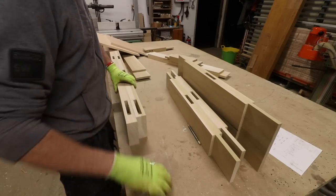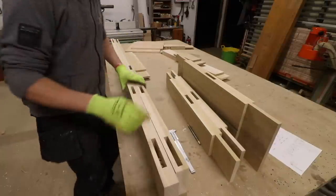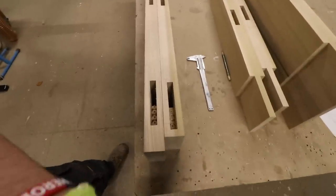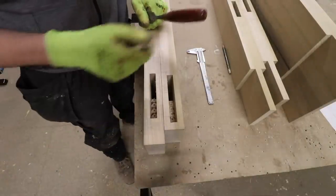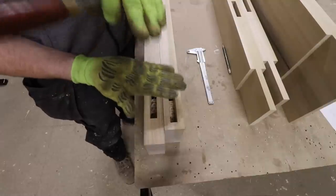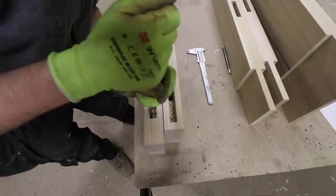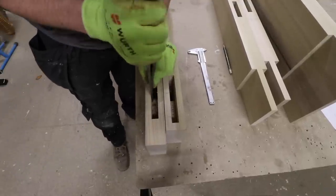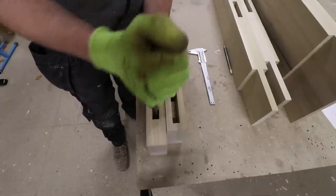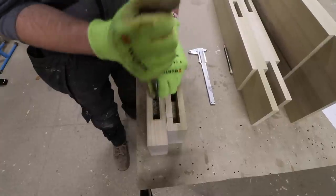That's the mortises and tenons done. In them haunch positions, we're just going to clean up the chaff that's left in the corners. Unless you want really finessed haunches and perfect tenons meeting them haunches for a door, on the top of a door you're not going to see, the best method really is just to mash your chisel down flush with the tenon and just get rid of that material that the tenon leaves behind.